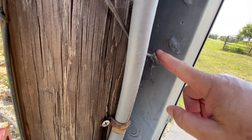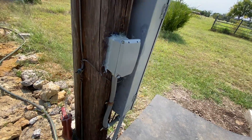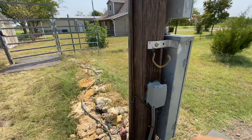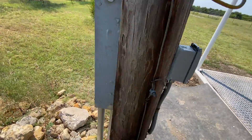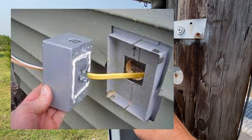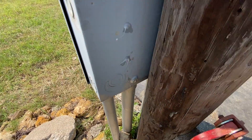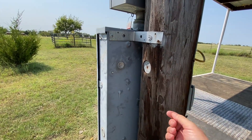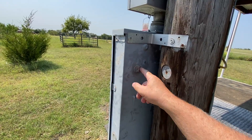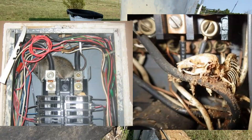There were a lot of little places. This was just a hole — they cut a hole and put a ground wire through. This box wasn't big enough; they went cheap. And when I ran the garage over to here, I needed a bigger box, so this is the box that I put in. But it had all these little holes from the factory so you could change things. This had an actual knockout — this is called a knockout plug. What happened is they knocked one of these out, were going to run a wire, and then changed it. The reason why that's knocked out is when I had professional electricians come over to plug in my generator. One guy put it in wrong, the other came back and pulled it out. So he plugged that with one of those plugs. I went ahead and caulked on the outside and on the inside. So any place you see caulk, hopefully this is going to stop the wasps and dirt and all kind of crap.